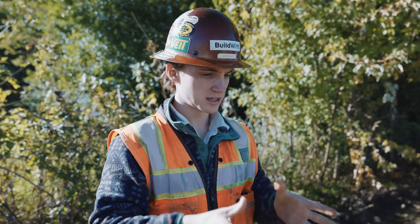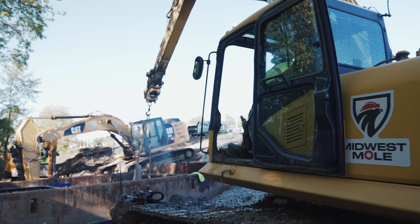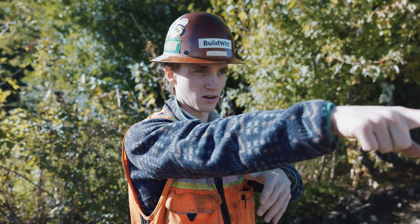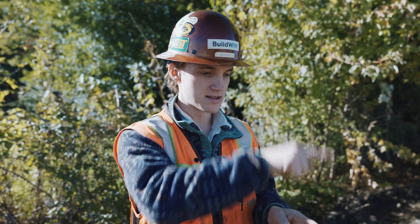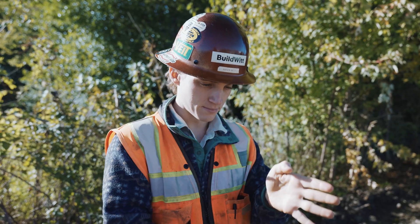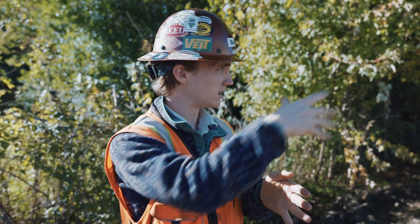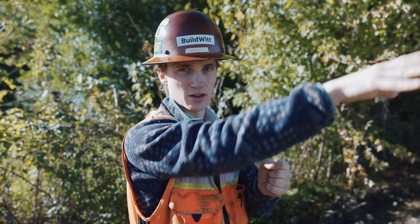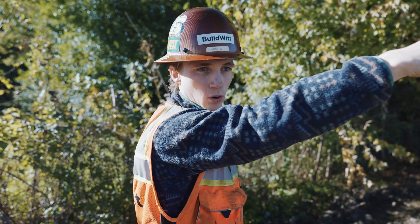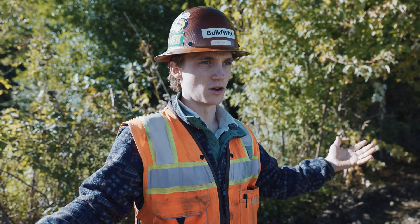They'll use these sections — probably 10 or 12-foot sections. They'll advance 10 or 12 feet, and then the excavator will pick another one up with the auger inside of it. You can see the augers behind me. They weld it all the way around, make sure it's nice and level, then advance it — next section, next section, until they're done. All the material's out and it's advanced all the way across the interstate. Then they pull the auger all the way back out.